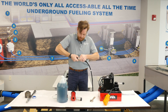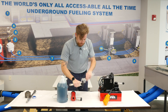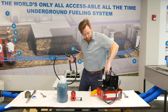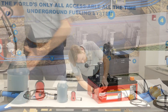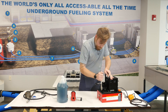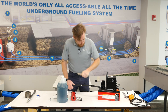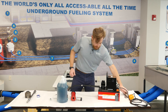So we're just going to put some Teflon tape on one end and we'll put our quick disconnect on the other. You're going to need two wrenches for this operation — to hold one and to tighten the quick connect. Once we have that connection good and tight, we'll be able to then connect the other end to our powerhouse. This powerhouse has a silver plug in it whenever you get it, and right here in the front is where our hose connection is going to go. Once we've got that with the thread-sealed Teflon tape, tighten that all the way down to make a tight hydraulic system.